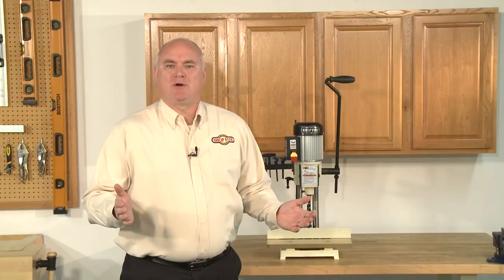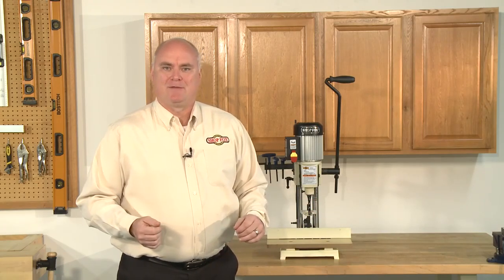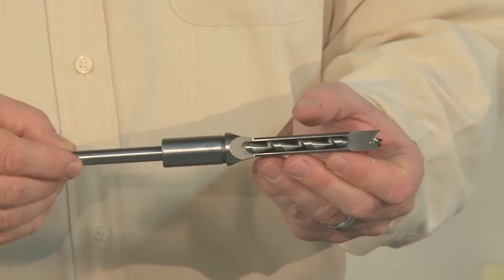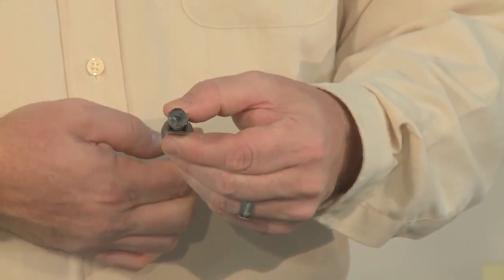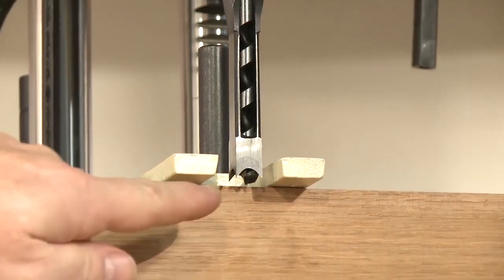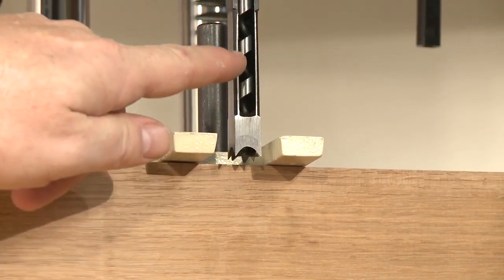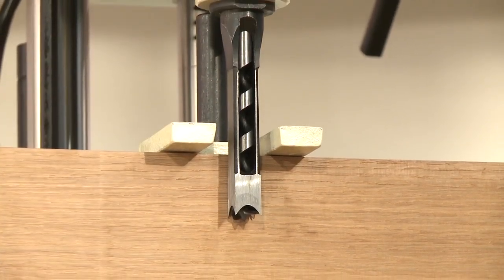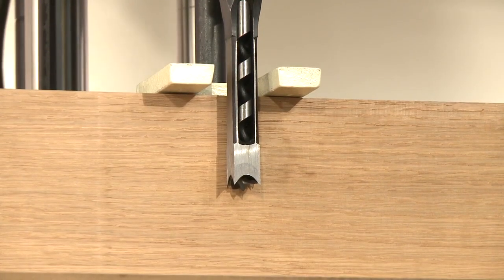So just how does one drill a square hole with a round bit in one quick stroke? This is done very simply with the right tools, using a hollow mortising chisel and the matched special mortising drill bit. The bit leads the cut into the wood while drawing the chips up and out of the open side of the chisel. The chisel simply cleans up the sides and squares off the corners as the sharp chisel assembly is pressed into the wood simultaneously.